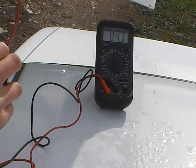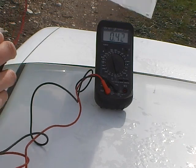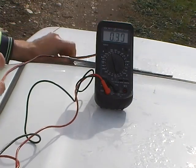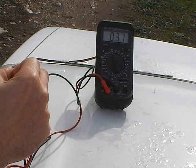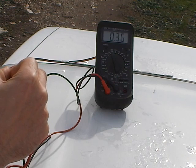This time of year the sun isn't that grand, so that reading is pretty lousy because the sunlight level is really quite low. But if the theoretical maximum is 1.24 amps under fantastic conditions, and I'm getting 1.06 when it could actually be a lot brighter during the summer, I think this panel's basically a goer.